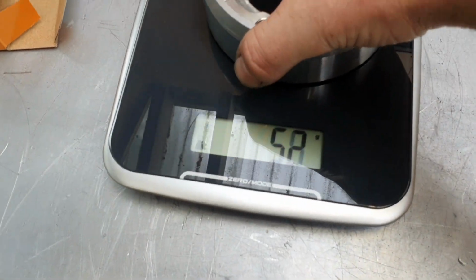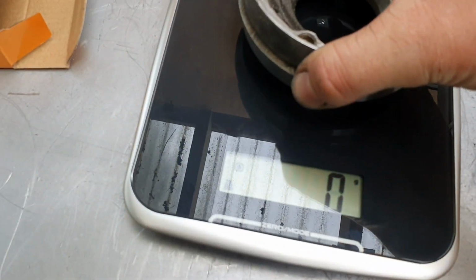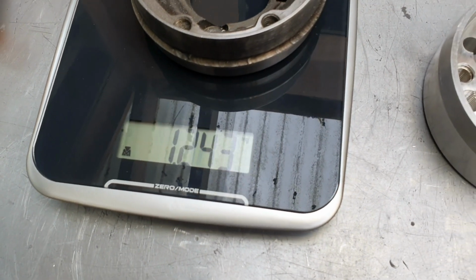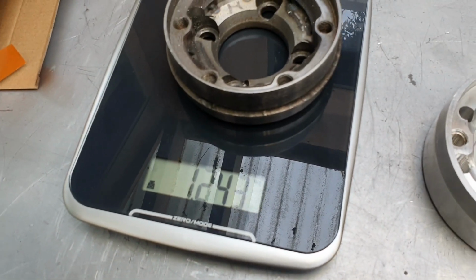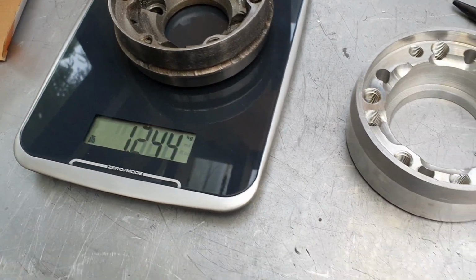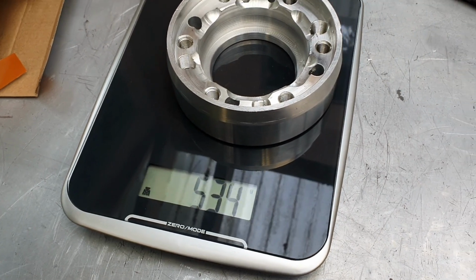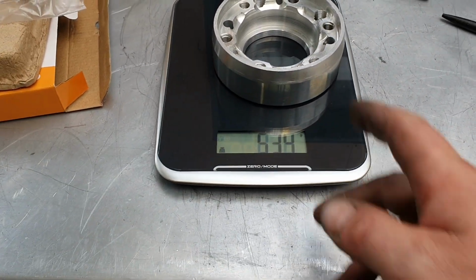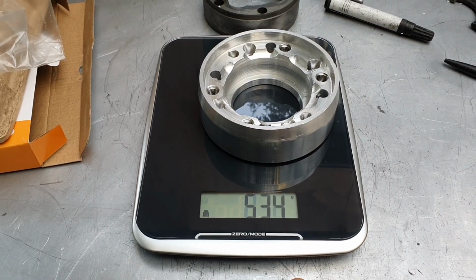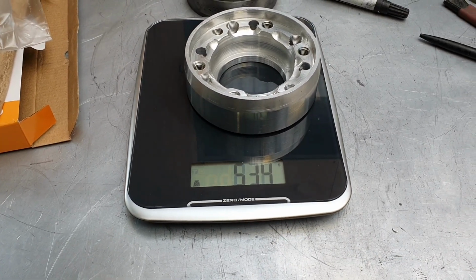So 534, and that's a steel. That's pretty much the same, isn't it? It's about the same height, near enough. That would be the equivalent sort of weight if we made it out of steel. Way less than half. Half would be 622. To make it easy, it just changed for me. 622 would be half. 534. So that's good, and that's, like I say, that's 7075. That's a very, very strong grade of aluminium. So we should have no problems with that at all.